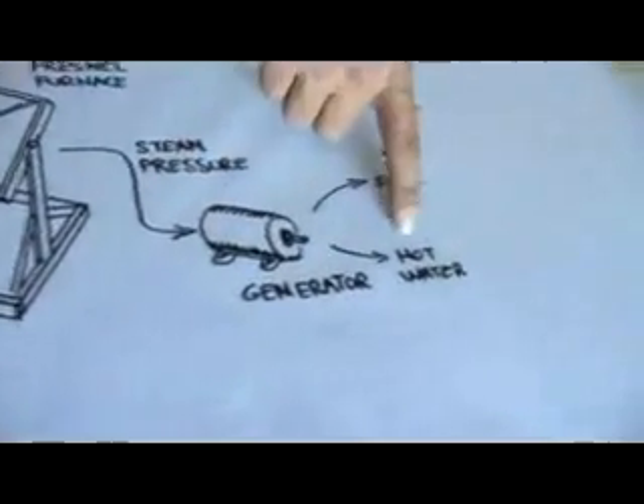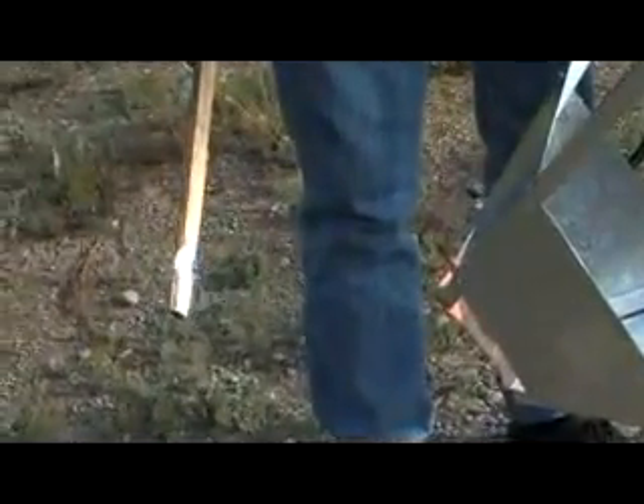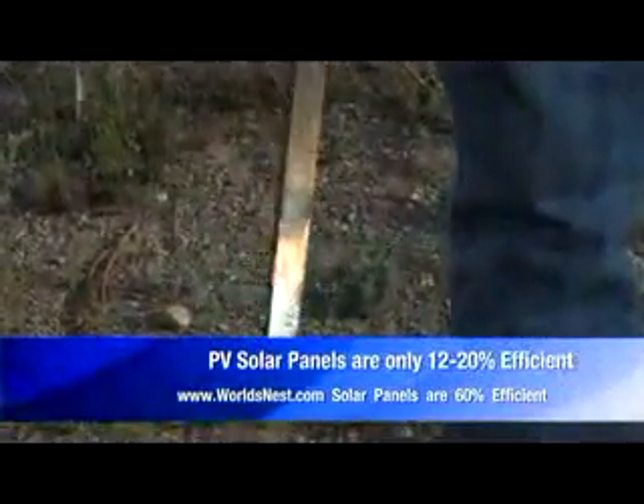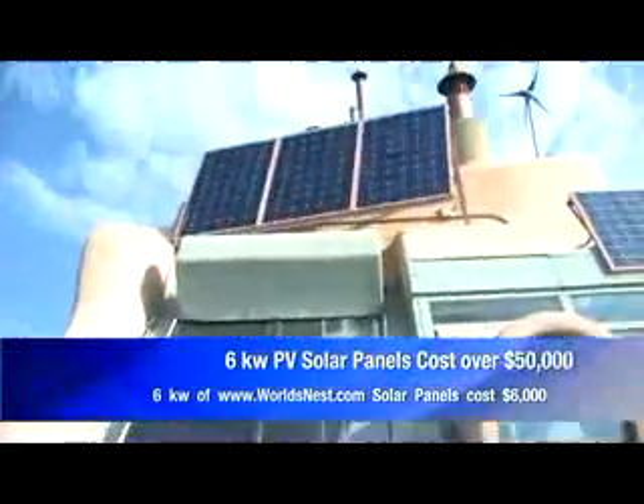We recover the hot water, which goes to a hot water storage system like a cistern or any regular hot water tank, and you get electrical power out of it. We're getting about 60% electrical conversion efficiency and the hot water is a free bonus. You can put a number of hot water collecting panels on your roof, and the heat of the sun can be used not just to create hot water, but also electrical power with high efficiency.